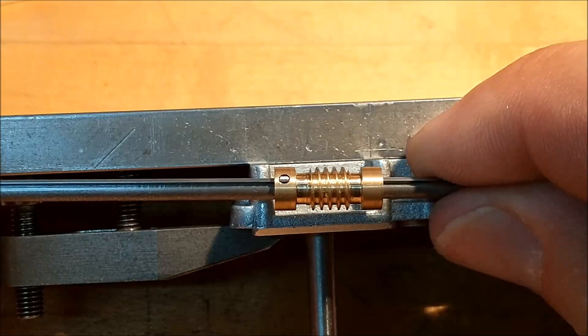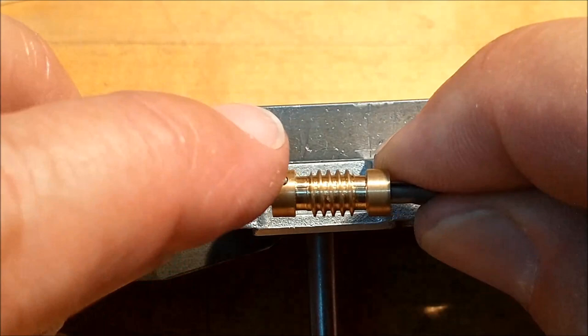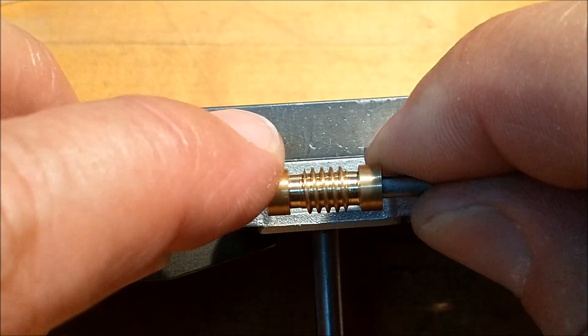As you can see, you don't want to go too deep with your undercuts, too deep with your gear teeth, or too deep with that broached hole or broached canal in the center for that slot. You can see some pressure remnant showing up in the bottom of the undercuts. That will not interfere with the mesh. I've checked it. So that's a good thing.